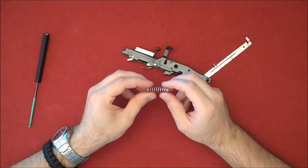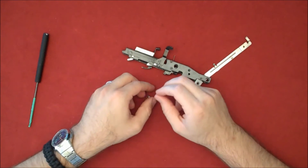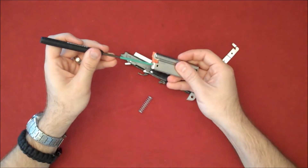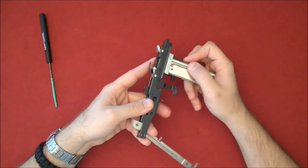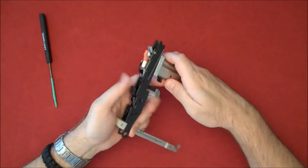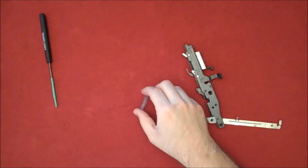One thing to mention about these springs is it does take a little bit of trial and error to find exactly the right type of spring and the tension it needs. You need the tension to be strong enough to push this down but weaker than the spring tension in the magazine. This nub right here is actually what pushes up the bolt catch when it's empty — watch the bolt catch go upward, now it's in the up position. So we need a spring strong enough to push this back down but not so strong that it overrides that magazine spring.